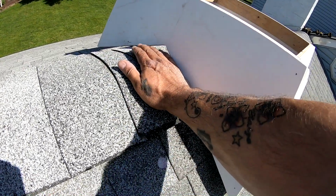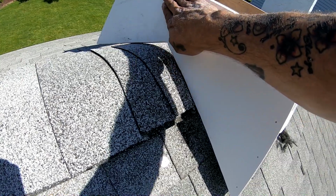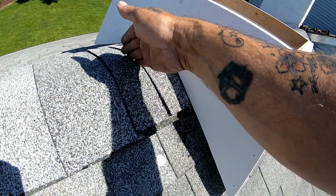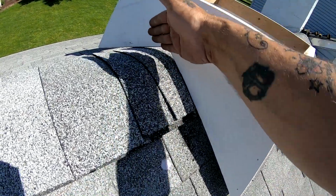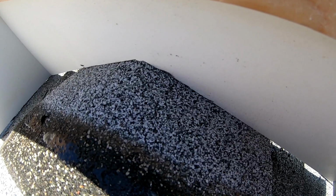If you cut it prematurely by measuring, because your cupola is on a little bit of an angle here, that angle will change and you'll probably be cutting way out here. So just be careful of that and don't cut your second groove for the other side of the cupola until the first side is done and looks like that.